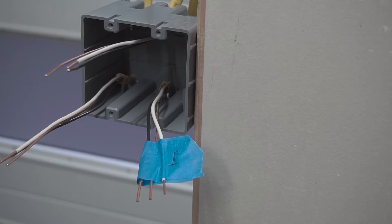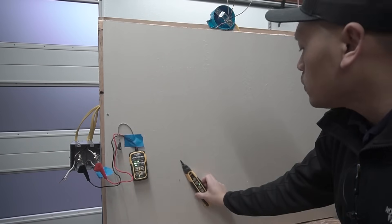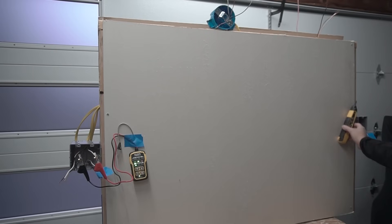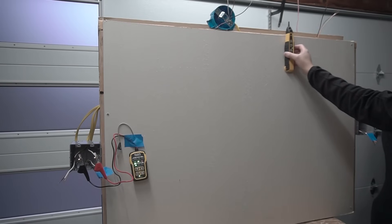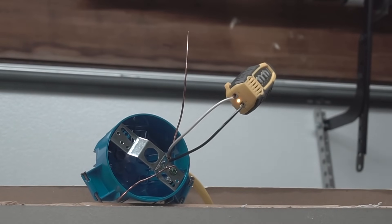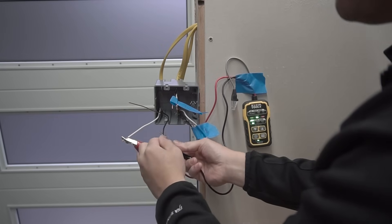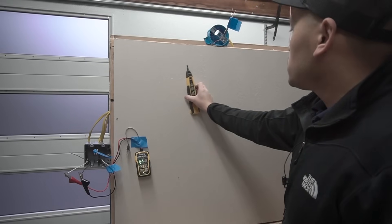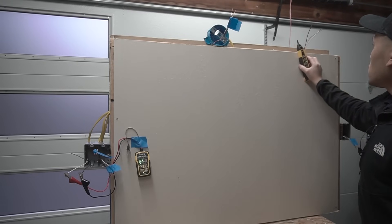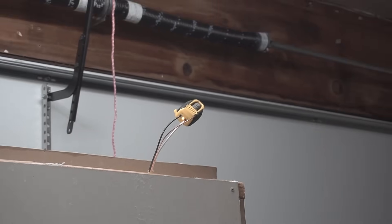Let's attach it to this next cable and see where it goes. The sound gets loud here, but if you deviate and go elsewhere — toward the single-gang box, for example — the sound is still there but very faint. Going to the miscellaneous wire, it's also faint. But as we get closer to this spot, it's solid and it lit up — that looks like the right pair. Connecting red to white and black to black: the tone is coming from here, not over there. It's a little faint in one direction but super loud right here, and it lit up — that's the right pair. We'll label that number three.